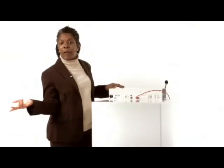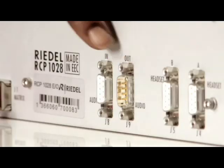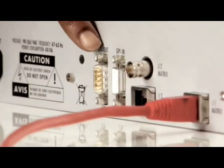To connect your panel to your mainframe, simply take the Cat5 cable from the Cat5 port of your frame and connect it to your panel. There we are. Nothing else needs to be done. No additional wiring for data. And now, sit down if you're not sitting already. Each 1000 and 2100 series panel has an additional analog audio in and out and a GPI connector. So you can have the panel in 2-channel audio mode and trigger GPIs over just the one cable attached to your matrix. Now that's what I call intelligent thinking.